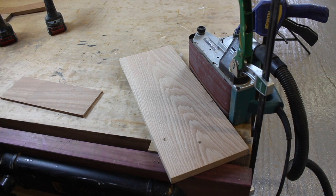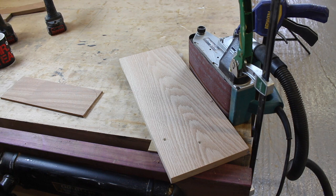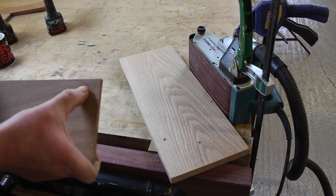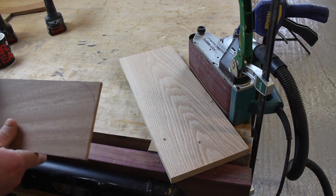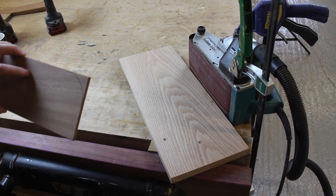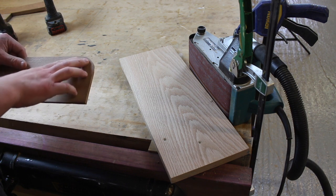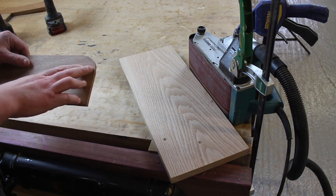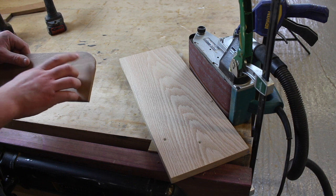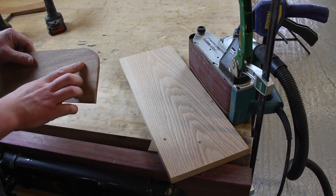I'll show you how you can clean up some pretty rough cut parts or rounded pieces just using that simple little setup. I'm going to sketch out a basic part similar to what I was making on the deck boards for Rocket, using my trusty mug as a radius. Cutting a piece like this might have to be quite accurate and fit inside another radius where you're really going to see the difference — this is a good way to make sure it's spot on. I'll just rough cut that with a jigsaw and then show you shaping it. My other tip really is to always work to a line. As long as you've got a line there, you know where you are with the piece of wood. The second that you sand or cut over that line, you lose all reference. So if you're going to rough cut that with a jigsaw, always cut on the outside of that line. The same with sanding — I can just slowly work down to that line and I know exactly where I am with the part.